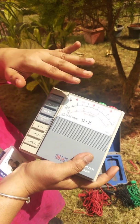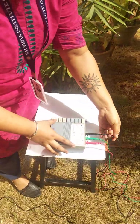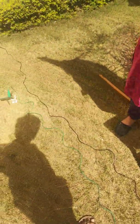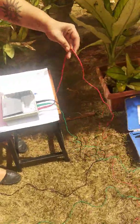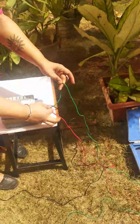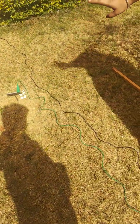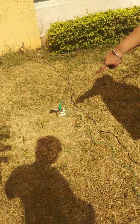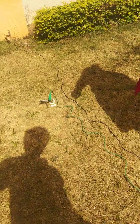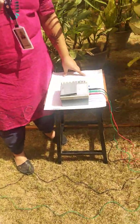You will click on the measure button. Now let us see how to connect the Megger kit with the electrode terminals. Please note that the black terminal is connected to the earth electrode, the red terminal is connected to the current electrode at the farthest end, and the green terminal for the potential electrode is connected to take the first reading. The first reading always begins with small d as the first value, and the last reading will always end as capital D minus small d — the last reading is always less than capital D.